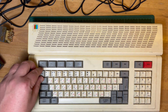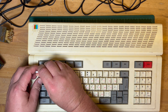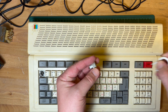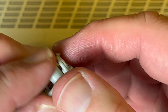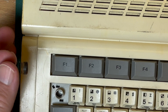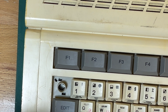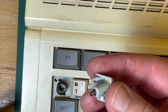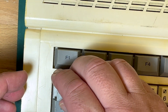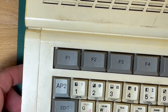Actually, let's have a look at this keycap - what's going on with this keycap? It looks almost like a modern western keycap actually. And have a look over here - spring, and I guess membrane - yep, so it's a membrane keyboard down there. So it's basically like - this is 94 - so I guess this is like the kind of membrane keyboards we had in the 80s, like on the Amstrad, things like that. Amstrad CPC. So why is that sticky? Don't know, I might have to give it a bit of a spray. Let's open her up and see what we've got.